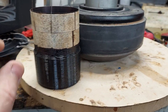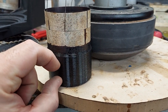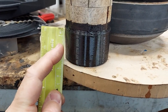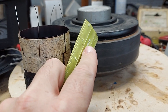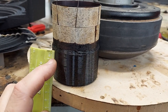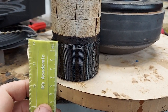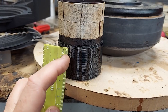Rather than doing it on paper, I like just taking the measurement directly. So getting the ruler — this is about 40 millimeters, so the center is 20. What you do is take half the thickness. If the thickness is 20 millimeters, you take half of that, which is 10. So then you want to go 10 millimeters north of center. Your center is 20, go 10 millimeters north — right there at the 10 millimeter mark. Then you mark it with a little silver Sharpie — link in the description. Some people have never heard of a silver Sharpie, but yes, they exist.